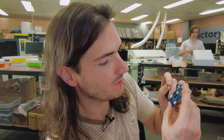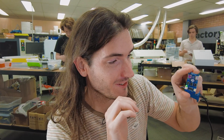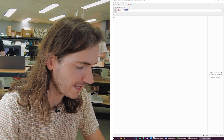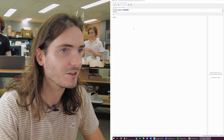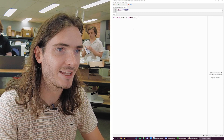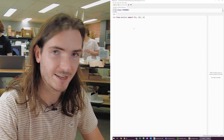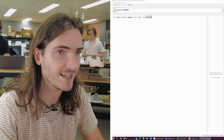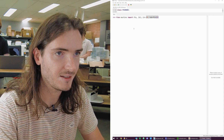There's nothing else for it but to fire it up and drive a servo. I'll plug it in and we ought to get a green light. We at least have power and ground the right way and nothing is blowing up on the board. Let's see if we can detect this device. I've got my Python REPL and we can just do an I2C scan. From machine, we need to import Pin and I2C. We want to create an instance of the I2C bus and set it up on bus 0 with SDA equal to pin 8.